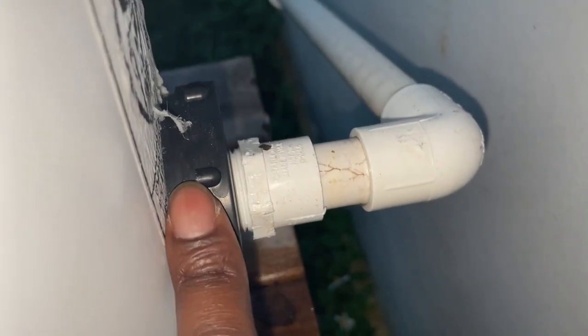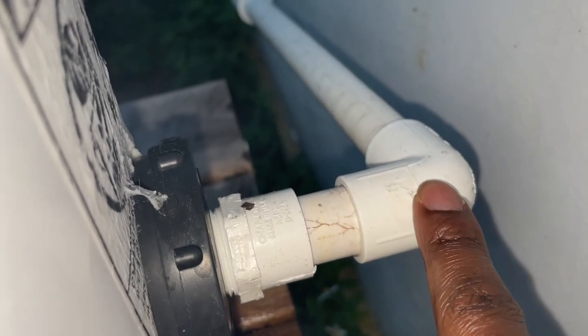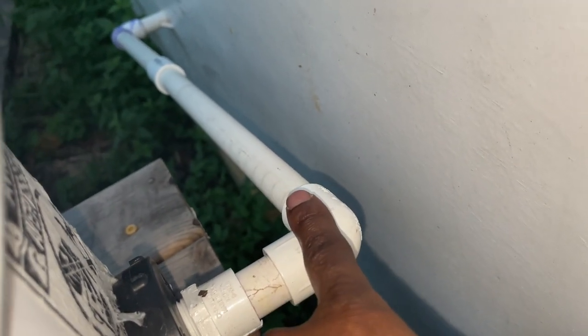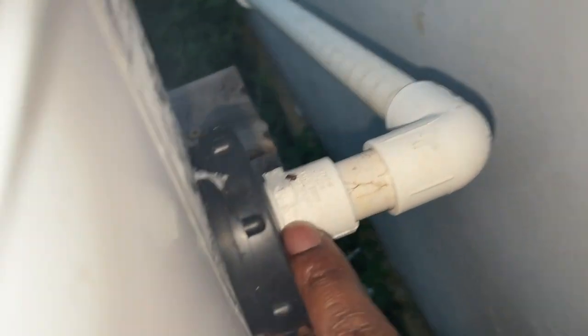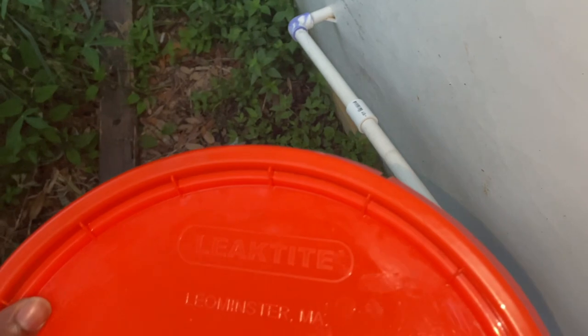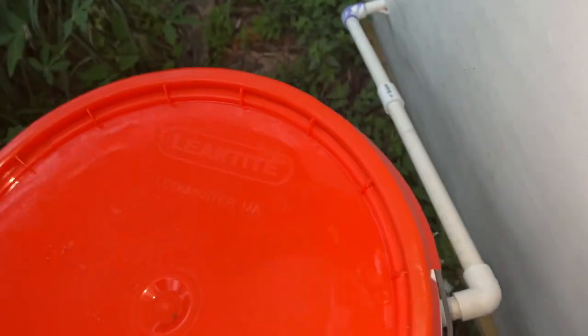But you spin this situation and then it goes to this here device, connect, boom, boom, data, right? And so I had to cut the piece there, add this here length of half inch PVC, put a little turn to it, little connector, and then a little spin valve. Let me show you the inside of the bucket, which allows for the water to be covered. But making those adjustments is what changed the game and allowed me to have ultimately the goal that I was going for, which is an automatic waterer.